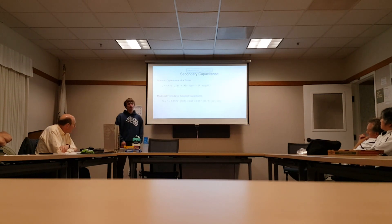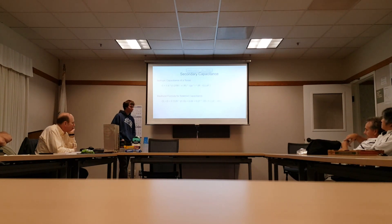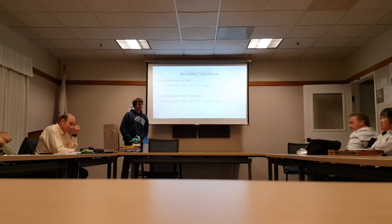The capacitance we didn't measure directly, but we got that by measuring the resonant frequency of the system. Our resonant frequency was measured at about 56 kilohertz, and we went into it expecting 50 kilohertz — so we were about 85% close. There's no actual physical capacitor; it's formed by the toroids and the earth. Even if there weren't any earth, that wouldn't really change — it's self-capacitance.